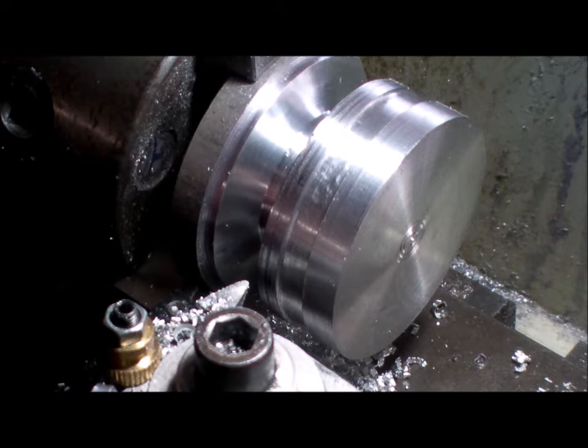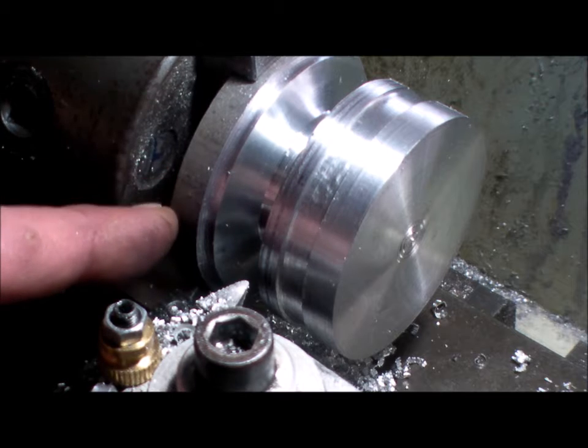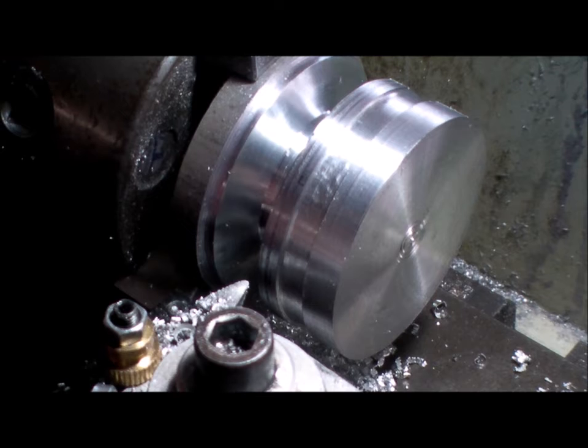I won't bother trying to cut it off. One, I can't cut it off in this position, so I'd have to flip it around. Then it'll be sticking out here. This machine doesn't like it, although this is the first success I've had with the cut-off blade. I'm losing it all today in terms. Anyhow, it doesn't like it, and if I come further out, it's going to vibrate a lot more. And it's a painful job. Be quicker just to machine that off.